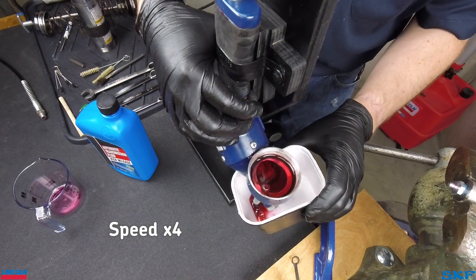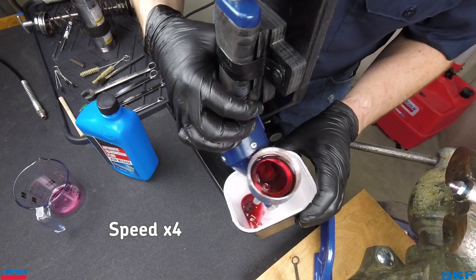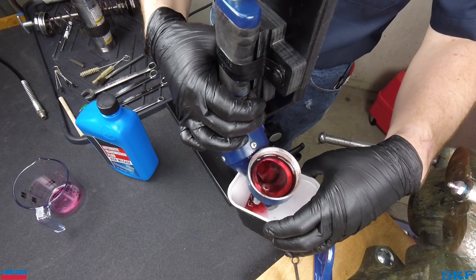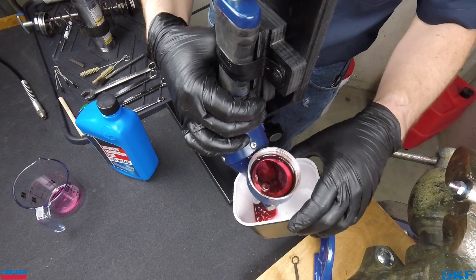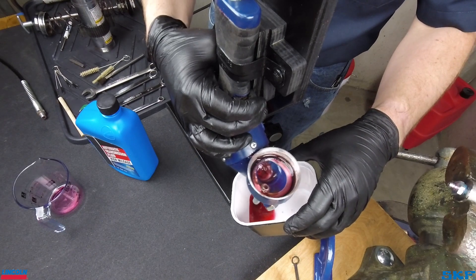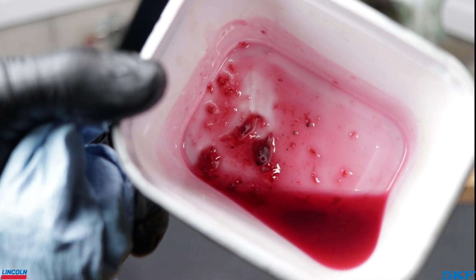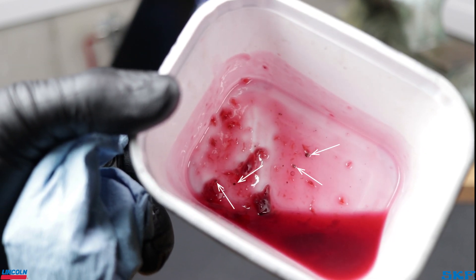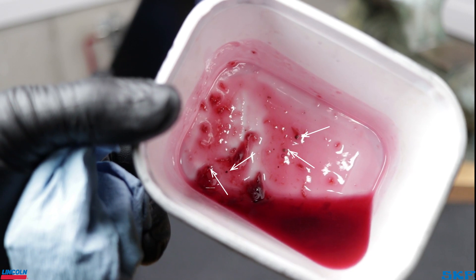In some cases, this is all you will need. However, as we can see with this gun, it was not dispensing the fluid out as originally hoped to demonstrate. After about a minute or so of toggling cycle rate and air pressure, the fluid finally drained. Inspecting the dispensed fluid shows we pushed out what appears to be small pebbles and bits of rubber or plastic — possible reasons the fluid did not originally pass through.